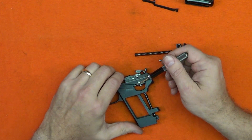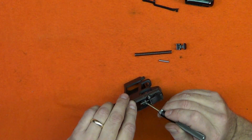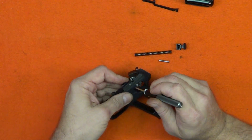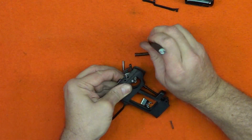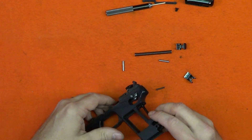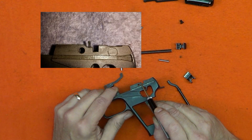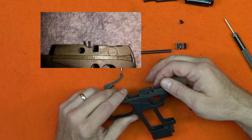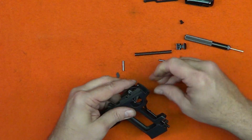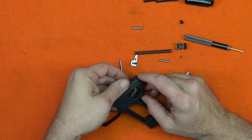The final two pins are the hammer and ejector pins. The ejector pin holds in the ejector bar and the sear. Additionally, the ejector pin holds in the drag spring in compression — that spring is held beneath the spring support. Place a little pressure on the spring support and press out the ejector pin. Be careful, as the sear and drag spring will pop loose, so cover the magazine well with your hand to contain them. Remove the ejector bar. Take careful note: there is an extremely tiny spring set into the frame under the back end of the ejector bar — that's one of those springs you can only drop once because you'll never find it again. Press out the hammer pin, remove the spring support, the disconnector spring, and then the hammer and disconnector.